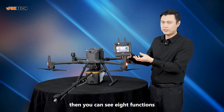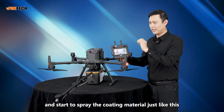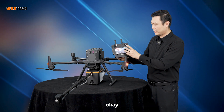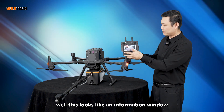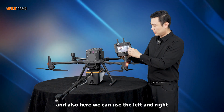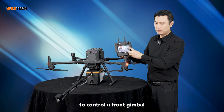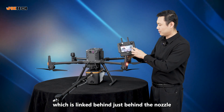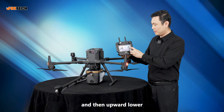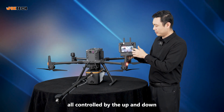Press the PSDK and you can see eight functions. One is spray — press it and the pump will activate and start spraying the coating material. There's also an information window showing the range from the wall or obstacle. You can use the left and right controls to control the front gimbal linked just behind the nozzle to do a swipe, and the up and down arrows control the upward and lower angles.